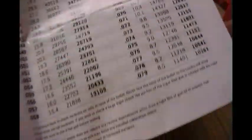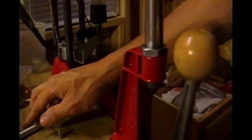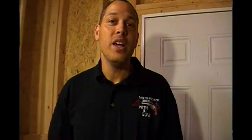So it's good to take an average of several. I would say going through all six, my guess would be about a BHN corresponding to 0.050 to 0.051. As long as you're reasonably close to that 10%, you'll get acceptable accuracy and very minimal leading. These are clearly good for 9mm applications because the pressures are right there, and they would certainly be good for most .357 Magnum applications as well. This alloy strength will work for stock .38 Special, but it's better to use a softer alloy — I tend to prefer wheel weights for that, more like a BHN of 11 or so.